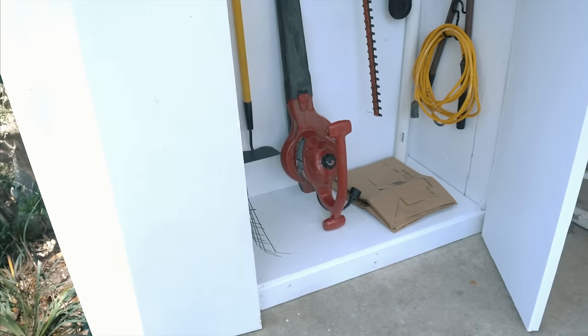I'm really happy with how it turned out and it's going to be super useful. Overall this is a relatively simple project — there's nothing really complex about the build, it's just a lot of steps. If you have a table saw and a miter saw that will make it faster for sure, but you could do this entire thing with a circular saw and a drill if that's all you've got. I will have plans for this available on my site. If you decide that you don't need something this tall, you could easily just change the height dimensions. One thing I have not done yet that I will do is mount it to the wall — something this big and heavy could be very dangerous if it fell over onto a child. I need to go to the store, get a big eyelet, put it into the 2x4 at the top, and then tie it to the wall with a strap. I can't do that yet because I don't have any Tapcon screws to drill into the brick.